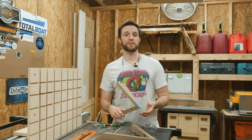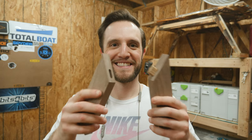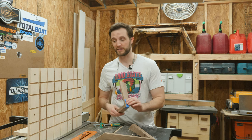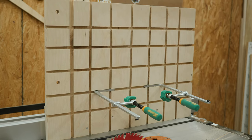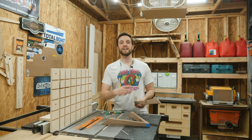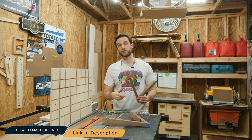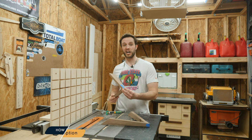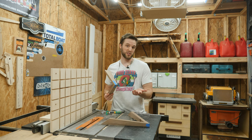And while I could have done something like dowels or dominoes inside here, I really want to try something different, and that's going to be making some splines. Now, about a week ago, I made a video about how to make this jig so that you can make splines, and if you want to check that out, click that link up here or look down in the description below. But I'm going to make some splines, and I'm actually going to make them contrasting with maple just so it looks a little bit more interesting.